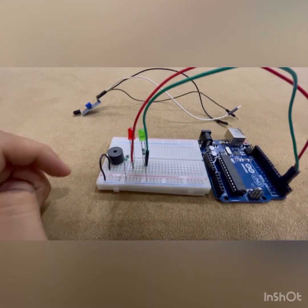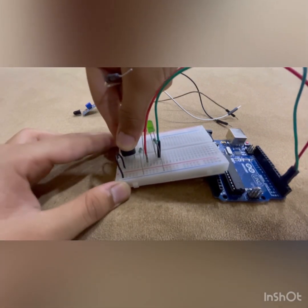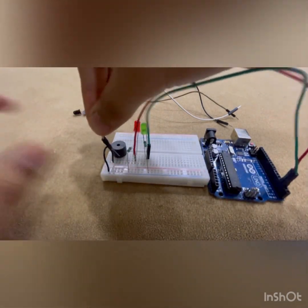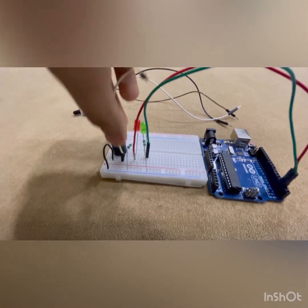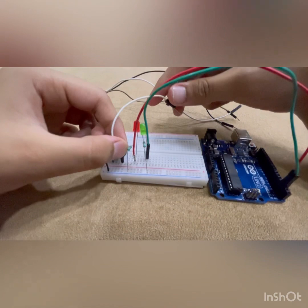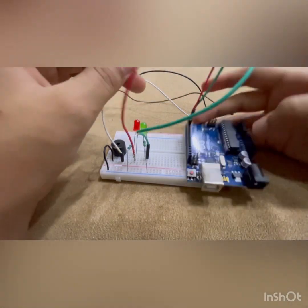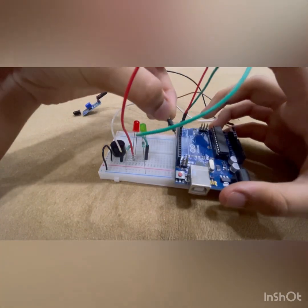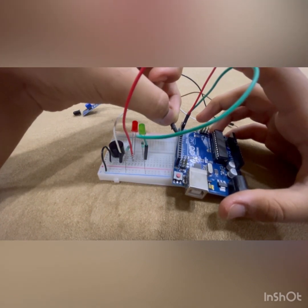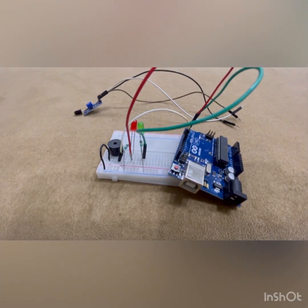Then we need to take one wire and connect it to the positive of the buzzer. There are two pin spaces, so one, two and connect it there. The other side you're going to be connecting to pin number 11. Since we can't reach pin 11 from there directly, we go: ground is 13, so 8, 9, 10, 11 — pin 11 is right there. Fixed it in. We are done with the connections of the components on the breadboard.